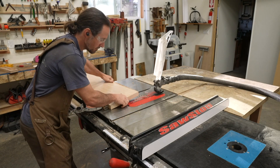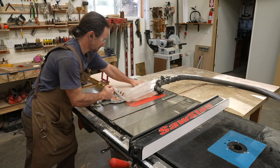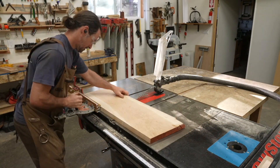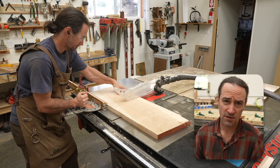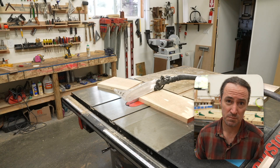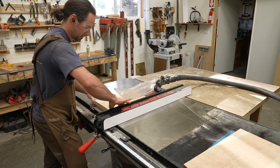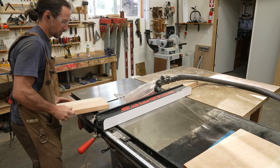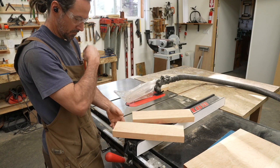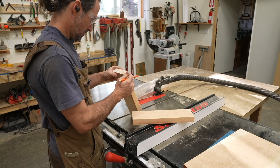I start with a piece of 6/4 cherry, which should be about an inch and a half for the nominal size, which really means it's about an inch and a quarter in actual size, and my project is designed for this specific stock height. It's fairly important that the stock starts at 1.25 inches — if it's thicker there will actually be some issues, so it's better to be a little bit on the thin side. I like to use one piece of cherry and cut it in half to use each side and have them be a matching set. I do pay attention to grain orientation and I try to make it so the grain is going with the flow of the actual utensil I'm making.